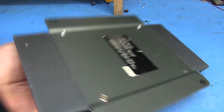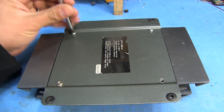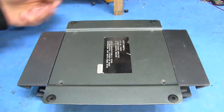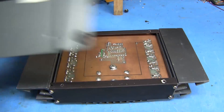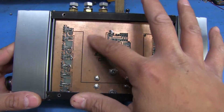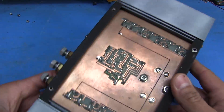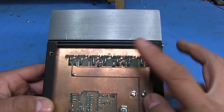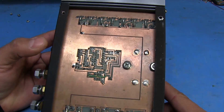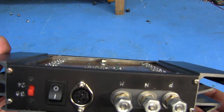On the bottom, just the plate - it's missing a screw because that one kind of stripped a little bit and wouldn't hold. These are just screws from a computer case. So we got those three - this lifts right off and inside we see the bottom of the circuit board. As you can see I used a lot of fill for these traces because I wanted to keep them as beefy as possible since this was meant to conduct a lot of current. I'm using a total of 16 MOSFETs on the top and bottom, and then just a bunch of freewheeling diodes right here - even though I think these MOSFETs already had some diodes built in. It's a little bit overkill to be honest, but I wanted it to not blow too easily.